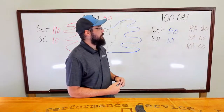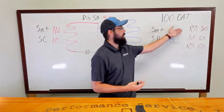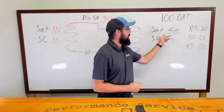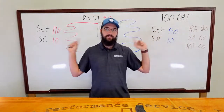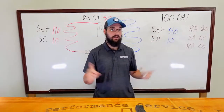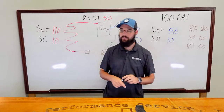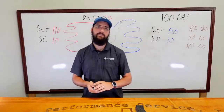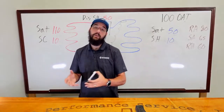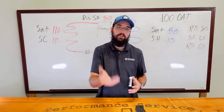So you've got 30 minutes or so of time that it wants to be running, or needs to be, which is allowing heat to stack in the space. Also, we've got a low compression ratio overall. It may not be dramatic. A lot of times they're not. Some feedback I got after the last time I gave this example was that it wasn't a super dramatic one. When I've caught these compressors being inefficient in the past, it's usually been really dramatic. Well, that's probably why you were able to catch it, because it was dramatic. And that's not a shot against anybody.